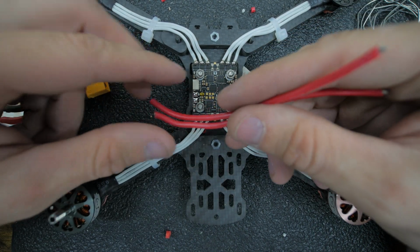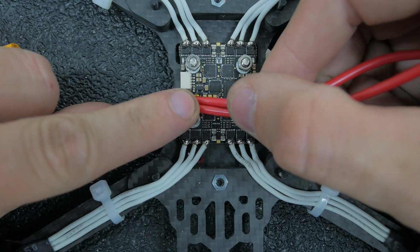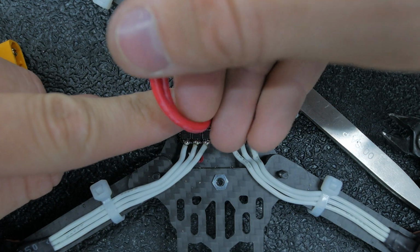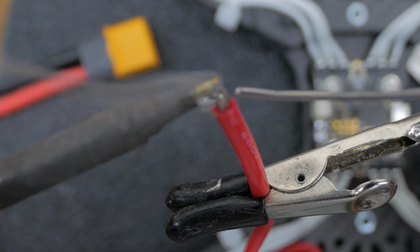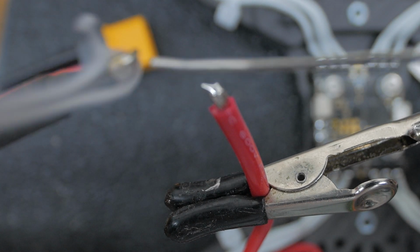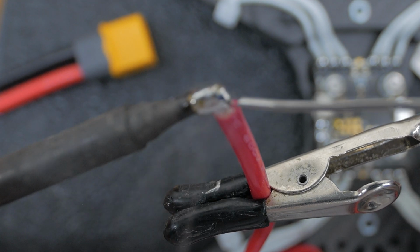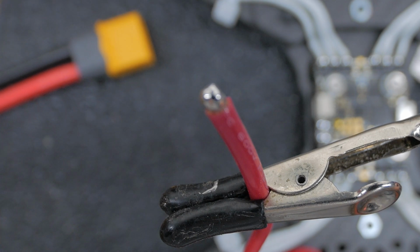I like to run my wires in. So I'm going to tin these up. I run them in, and then they do a little twist like this and come right around right there. And then we'll cut the top at the end. So I always touch a little bit of solder to the tip, get it started, then I drift the solder to the back side of the wire so it actually feeds through. You don't want to just put solder on the top of the wire. You want to pull it through it.